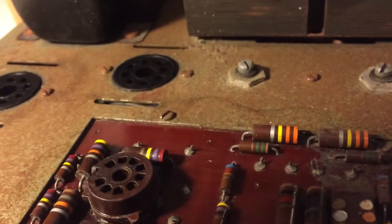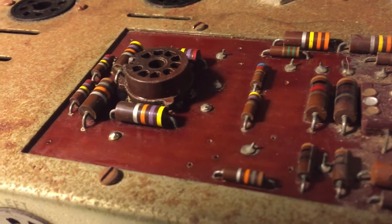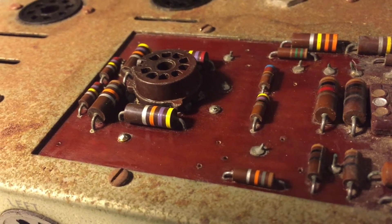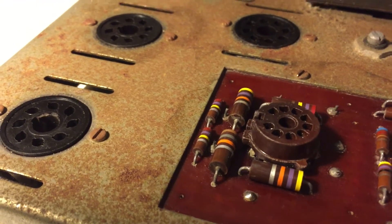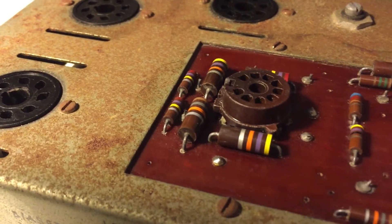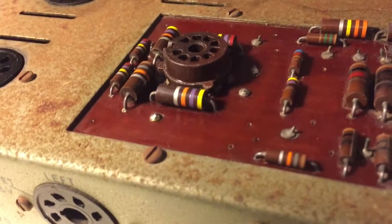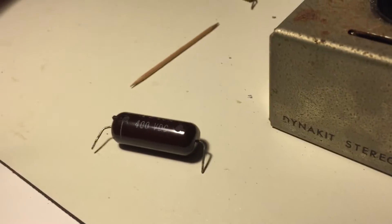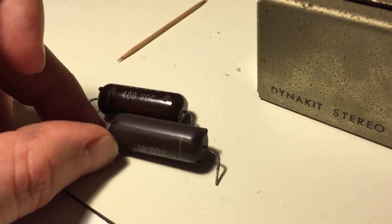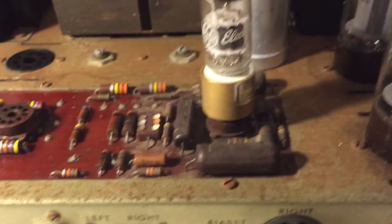I was able to measure all the resistors except for the ones in the back — the orange-orange-yellow and the brown-black-red — which seem to be attached to a circuit that's dragging them down. All the other ones tested just fine. The 270-ohm resistors over here that are supposed to be matched within 1% both read 302, but they both read exactly 302 — so as long as they're balanced it should be fine because I'll be making adjustments anyway with the potentiometer. I'm going to clean up these capacitors and put them back in the board, then get started on the other side.